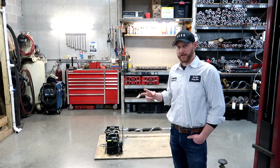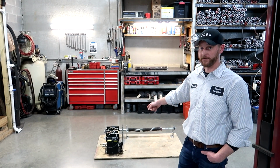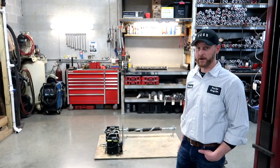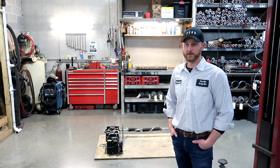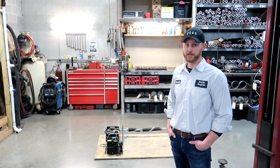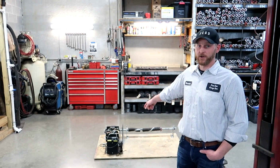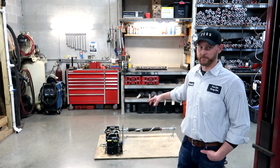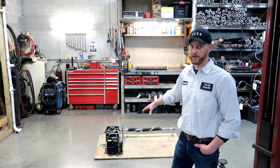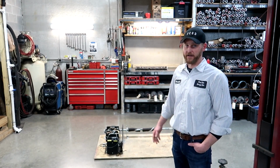Two reasons I made this video. Number one, just to show the sheer power of the GH operators. We talked about it a little bit in our Liftmaster Elite Series GH video, but these operators have a ton of torque, a massive amount of power. When you think about all the reductions that are involved, this is a ton of power, even just from a 1/2 horsepower unit.